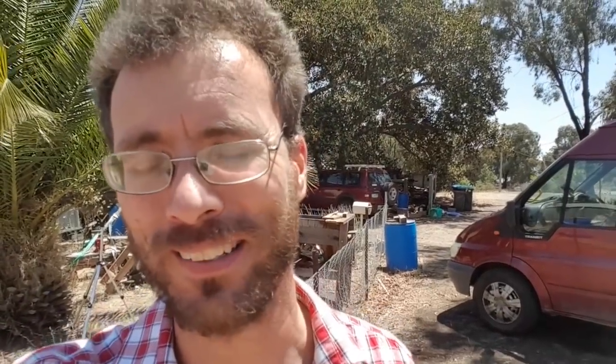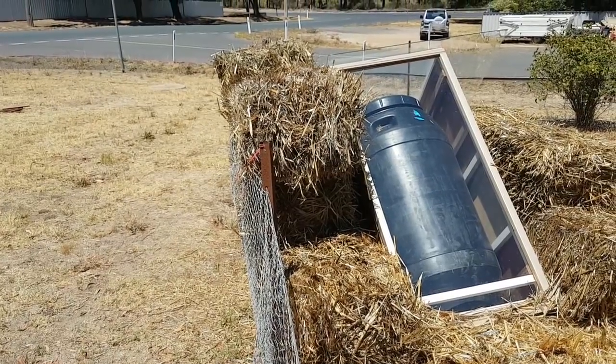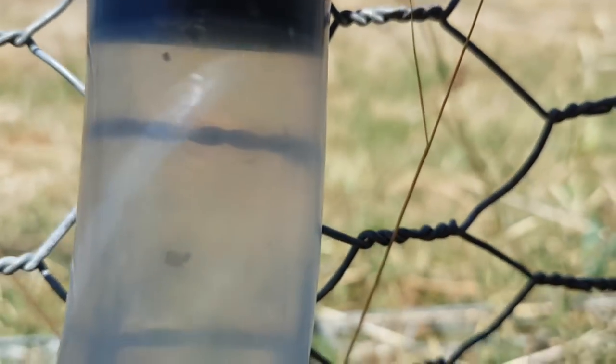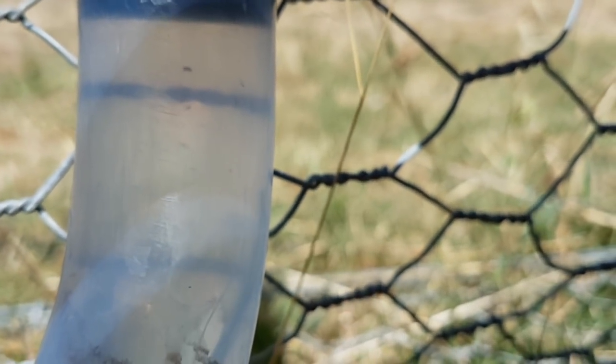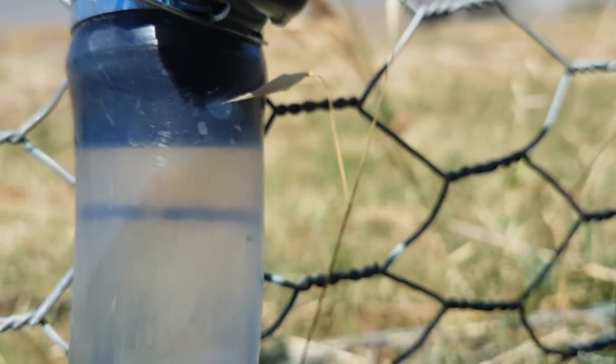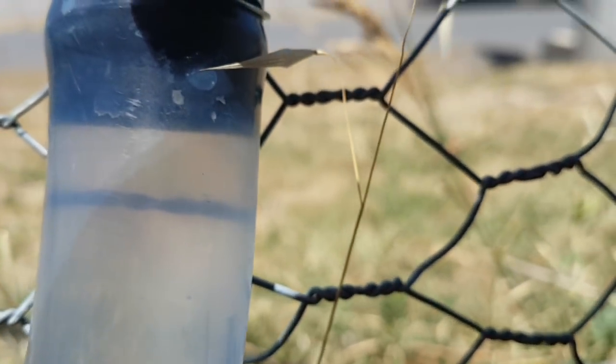So I'm just back from the Sunday market. Okay, so there it is — all set up and working. I've checked the sight glass down at the bottom of the thermosyphon loop. It's working. There are particles moving in there, there is a current flowing, which is awesome. Whether it's going to be enough to get to the target temperature — we nearly need 65 degrees C to melt that wax. We'll see in the morning. I'll hopefully come out and there'll be a nice cake of solidified wax sitting on top.